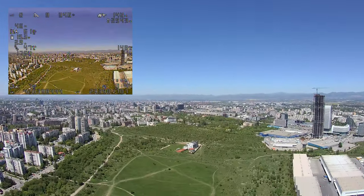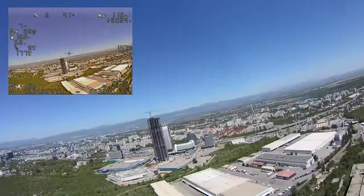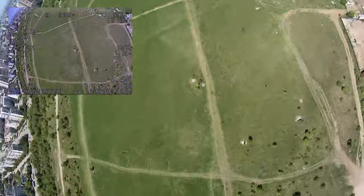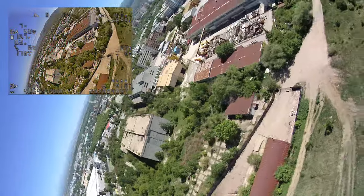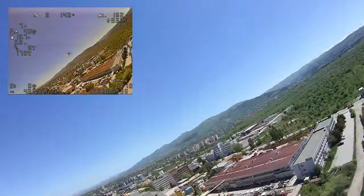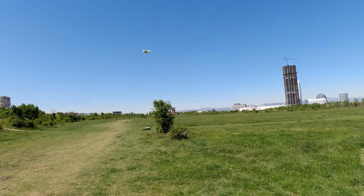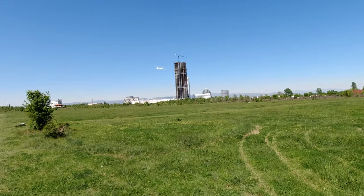The same test in manual mode had a slightly different outcome. The plane did go into a right turn, but not a tip stall by any measure — it was boring and slow so I just gave up pulling on the elevator. It could be the relatively small control surface throws that just don't allow it to over-do the up elevator and tip stall, which is a good thing. It builds confidence so you can let it glide hands-off and it will not try to kill itself in an instant. I also noticed the plane glides very well especially in FlyByWire A mode, which made landings literally a hands-off experience — and that doesn't happen often for me — so scoring extra points there.